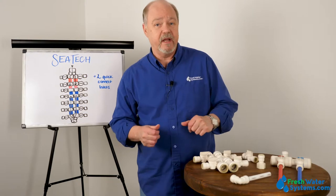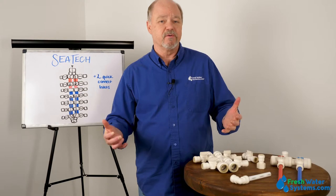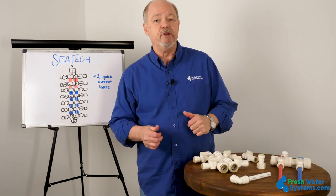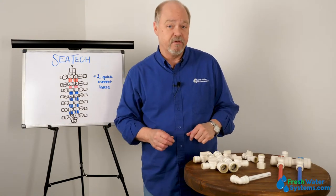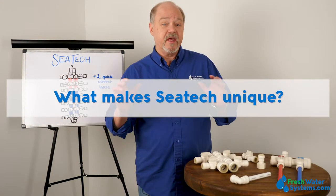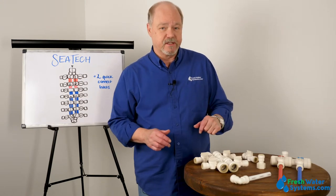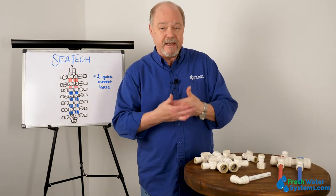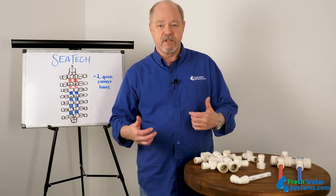The majority of CTEKs are made out of polysulfone, which is usually pretty resistant to most chemicals you might use, but depending upon what you're using, it's worth confirming compatibility with polysulfone. So what's unique about CTEK fittings? Well, the thing that really sets CTEK apart, at least in my mind, is their manifolding system. They make a variety of pieces and parts meant to connect together to create a distribution system or a manifold.